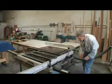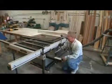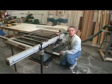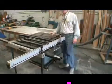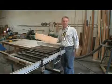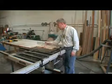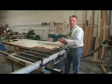Thirdly, you will inspect for the angles of the cut. And by that I mean how deep your blade sticks out above. The general rule is that if you're dealing with a material that's approximately, let's say, 3/4 of an inch as an example, your blade should be up above no more than approximately 1/8 of an inch.